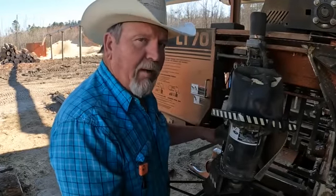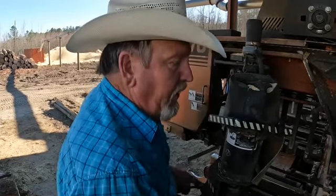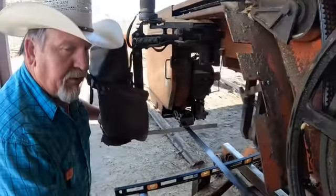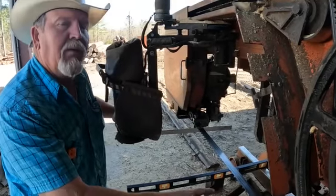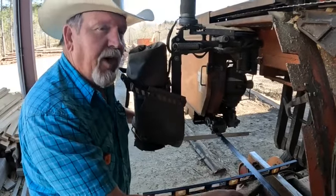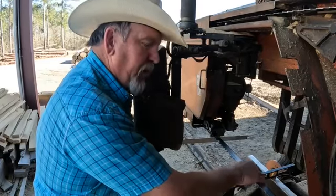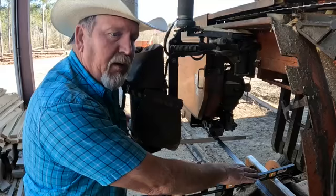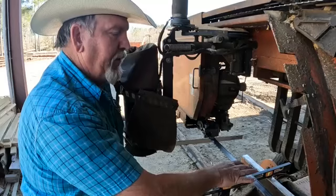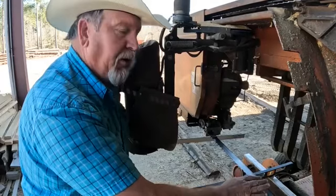Back when I ran the loose belts, I would check and clean underneath those belts every single time I changed the blade. When I change the blade on this machine, every single time I will grab the blade guide roller and see if there's any shake in them — it'll tell you quick if a bolt has worked loose. On the outside blade guide arm or roller, according to the manual, you take it out all the way, bring it in about a half inch, then hook your blade guide alignment tool on there and do the very same alignment measurement and procedure as on the inside blade guide.